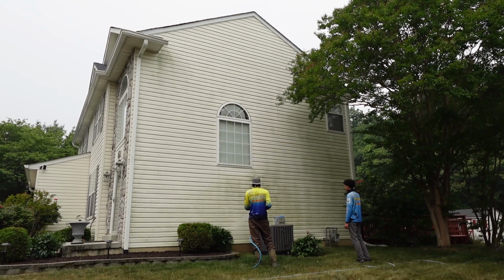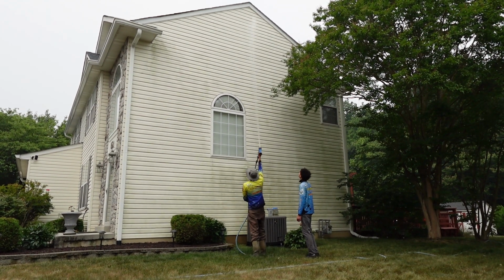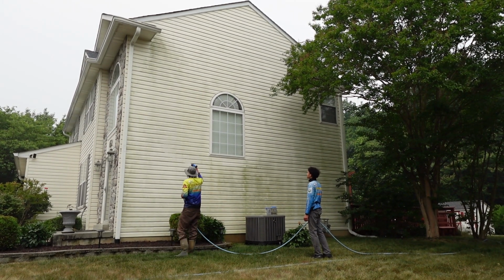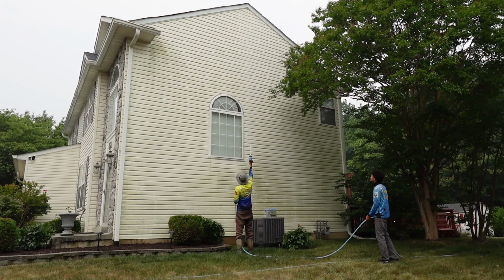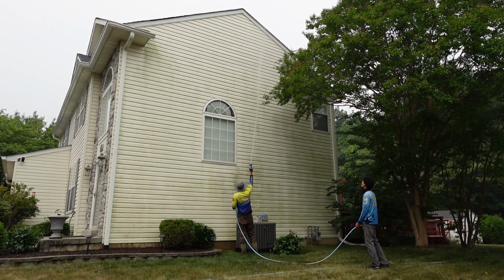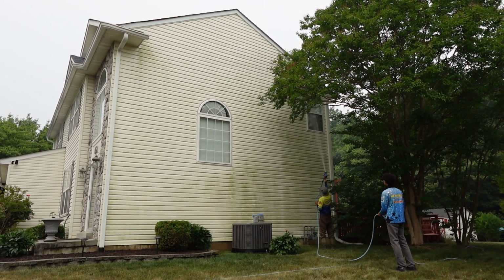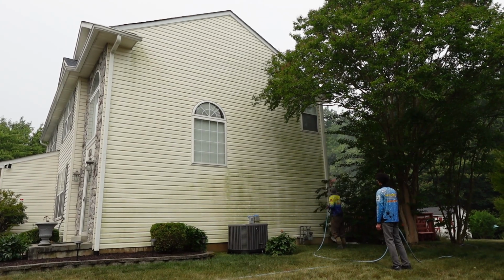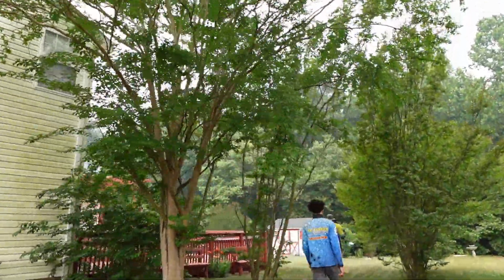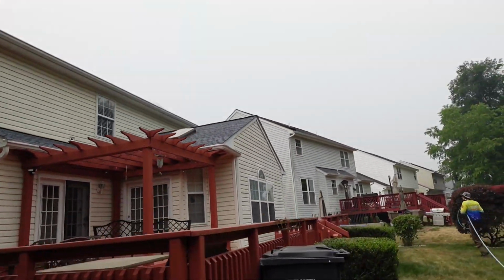If you guys are interested in seeing a downstreaming episode, I would suggest you go back into our archives, episode 3. It's called How to Pressure Wash a House with Chemicals. We are downstreaming there in that house. But anyway, this house here, the technique that we're using again, guys, is soft washing. And if you're wondering about the equipment being used by our lead, go back to episode 1 where we go over the trailer setup. The equipment being used here is an AR-45, and we are soft washing this with a 1.5% solution using our metering system or proportioner.